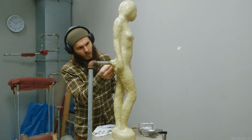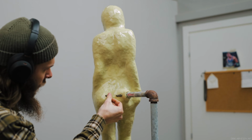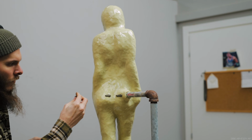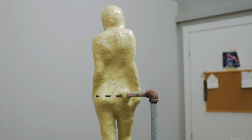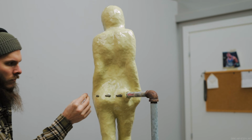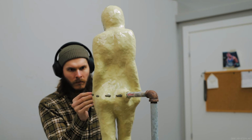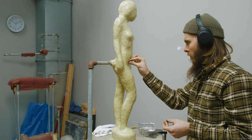At this moment, I'm going to decide on how many pieces of silicone I'm going to need to take this mold apart once it's done. Not only that, I'm going to decide how many pieces of mother mold I will need on top of my silicone to ensure that it comes off as well. The silicone is flexible, so a lot of the restrictions on where you place your silicone wall actually comes down to how and if your mother mold is going to come off.